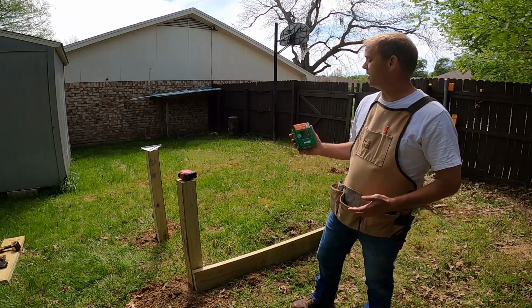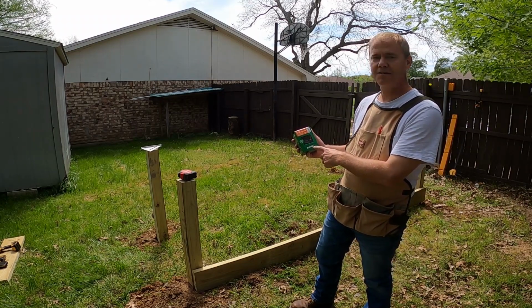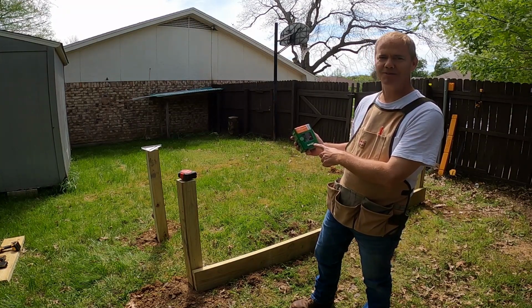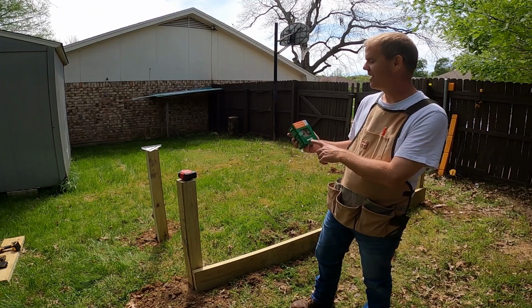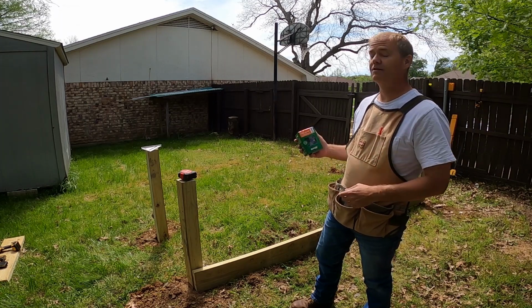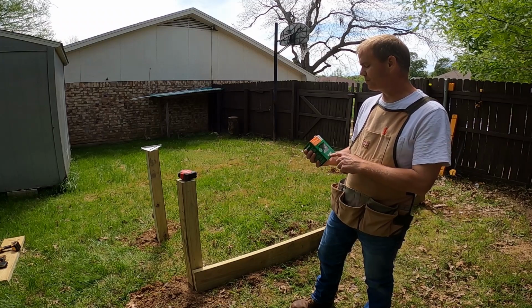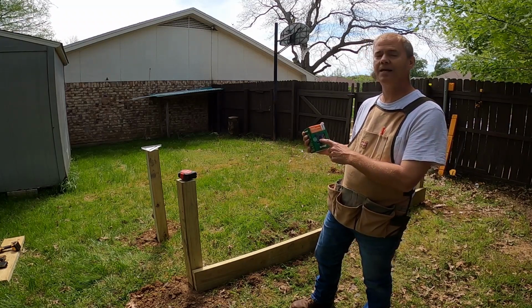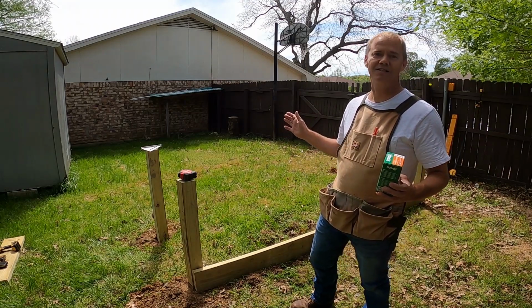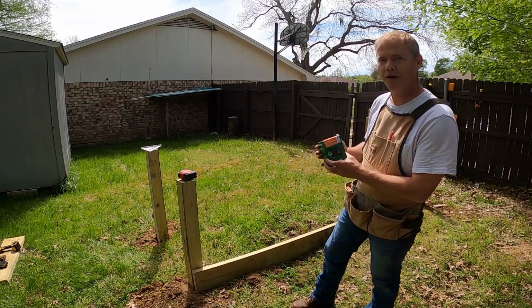Okay, the screws I'm using, this is a company called SPAX. They're not a sponsor. I mean, I have 5,500 subscribers. You're not going to get too many sponsors with that. But this is a great product. These are 3-inch screws. They're exterior deck screws, meaning they can withstand the weather. But the nice thing about SPAX is they have a patented tip where you don't have to drill a pilot hole before you start screwing them in, which is a massive time saver. So I recommend these. These are the best.